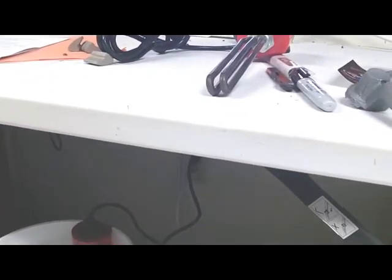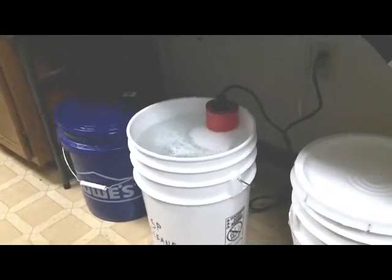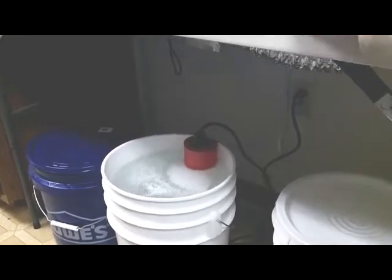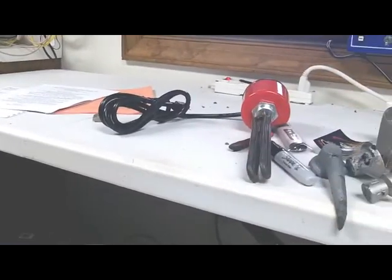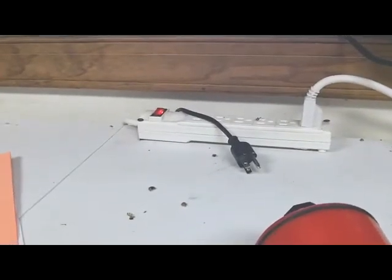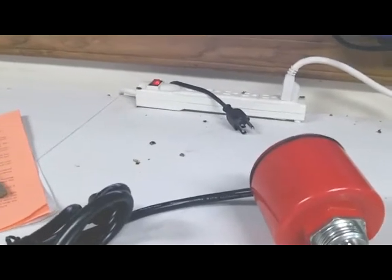And so I've got all of that. And as I said, I'm just taking it one step at a time. I'm getting this degreaser. Oh, the other thing I'm going to have to do, it's already apparent. They tell you in the instructions for these heaters, these things, when they're at full force, are drawing 16 amps. So they say make sure you got a dedicated line for each one of them. So the first thing I did was, I've got these little cheap power strips. I plugged it into that, and it didn't last long at all. The little circuit breaker inside this power strip kicked pretty quick. I don't know what it's set for as far as amperage is concerned, but so I took it down and plugged it in the actual wall outlet, and so far it's held for a pretty good while.